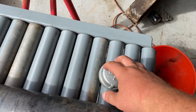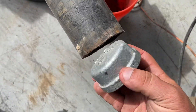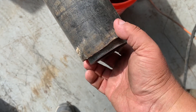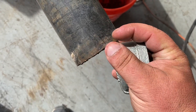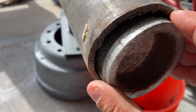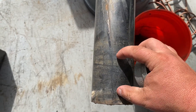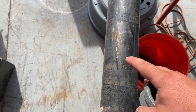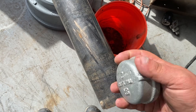So what we're going to do is take some of this tubing and cut it off clean. All modern caps typically have these two ears. We'll drill and tap on opposite sides, put some bolts in, and I'll put them in the lathe and really shave the head down. This is quarter wall so there won't be much fear of breaking, but just for clearance reasons. Then we'll lop this off, get a clean cut, make it about that deep, do our drilling and tapping, weld a piece to it, and weld it to a normal street key — like a one-inch pipe with a handle on top.